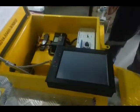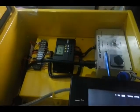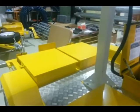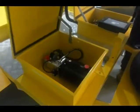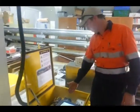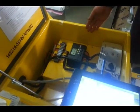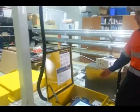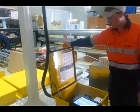Here we have the actual voltage and current display for the batteries. The batteries are located at the back two compartments of the actual trailer. We also have the hydraulic pump located here next to the control box. On our voltage meter we have 12.7 volts. Fully charged, it should read between 13 and 14 volts. If it goes below 12 volts, that's when we need to charge. There's a 240-volt charger located in the back box with the batteries to charge up from there.